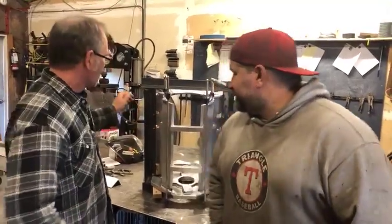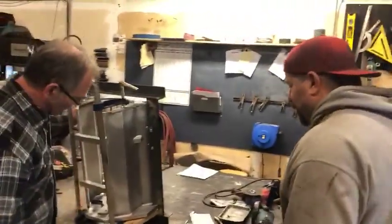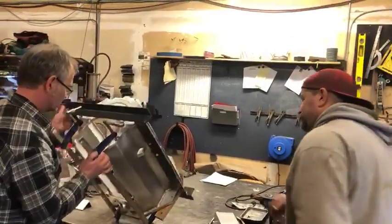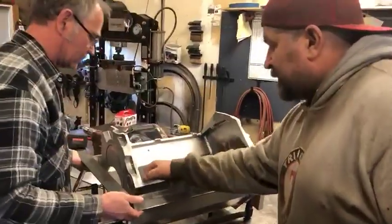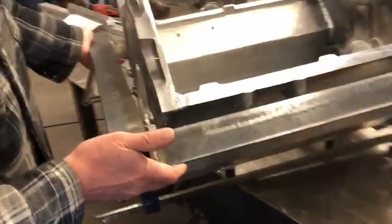It works at Toddum Welding. This is Brian — he welded up my engine for me. Any problems with this, Brian? The cast was very clean. The weld went in good. Had to preheat. We had to dig back — we back welded it. I dug down behind every weld just to make sure you had full penetration.